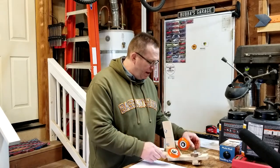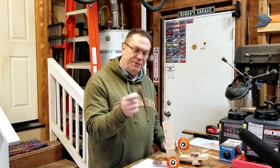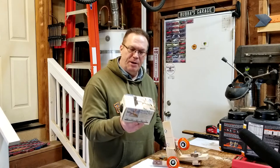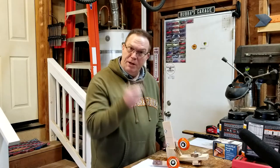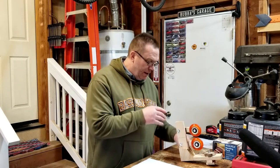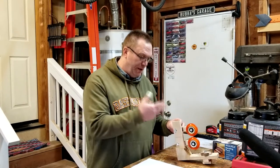What made it nice and convenient is I used sandpaper strips from one of these little sets - this one's from Rockler, and other companies make them - where you just pull off and tear off what you need. They happened to be one inch wide, which is perfect. You just cut off however much you need. So with those three additions - the epoxied T-nut, washers under knobs, and sandpaper on the arms - it made this a more functional piece of kit.